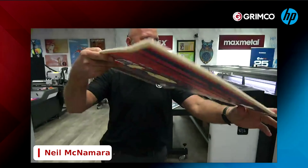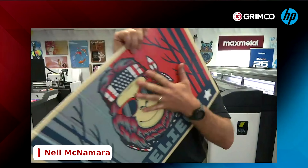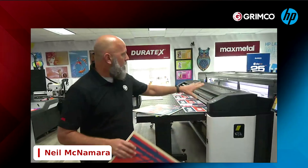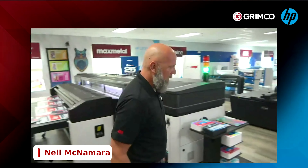You can see — even printed double-sided — because we're using nice corona-treated Coroplast, it gets great ink adhesion. But with the R-series, there's no hand-feel to latex ink. It's the same ink HP has used with their latex roll-to-roll machines for years. I can't tell where it was printed versus not printed. No smell either — we need to invent Smell-O-Vision for webinars. This machine running with a water-based ink formula means there's no odor, no fumes. It has GreenGuard Gold as well as EcoLogo certifications. You can work around this machine all day and not go home smelling like fumes from a UV or solvent machine. Latex printing is perfectly suited for sensitive environments like hospitals or schools where air quality is a concern.